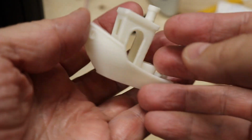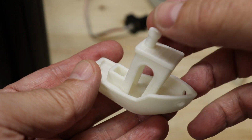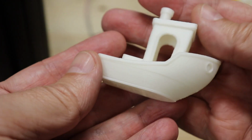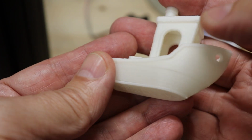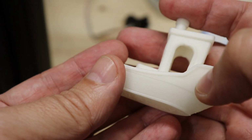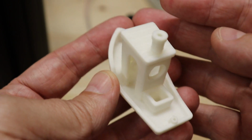So this was a 36-minute Benchy, and it was even slowed down because of that minimum layer time here on the top. So at least it came out good, and I really cannot see big problems with it. Here I can see one horizontal line and a little bit more ghosting here. I'm not sure it'll be visible. But otherwise no stringing at all.